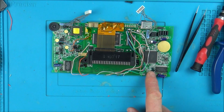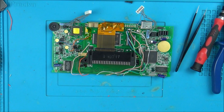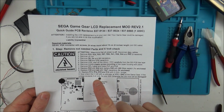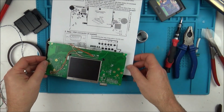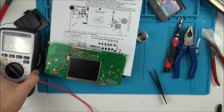Right, before I scrape that off, I'm going to go through every single connection one more time. I'm just going to make sure I've done every single capacitor. I mean, right now I'm 100% sure I have, but obviously it's not working, is it? So I don't want to start ripping apart this if, for example, I've removed the wrong capacitor or something like that. Right, okay, I've checked everything up to here. Remember, we were getting the 5 volts. So surely if there was something wrong under this solder mask, would we still be getting the 5 volts? If that was incorrect?